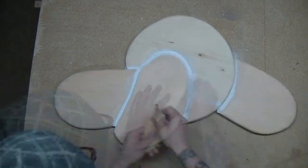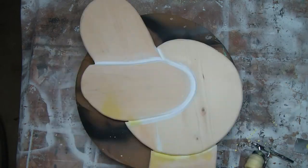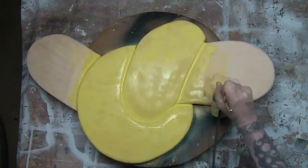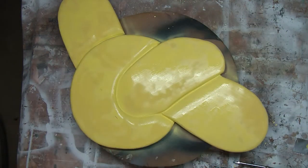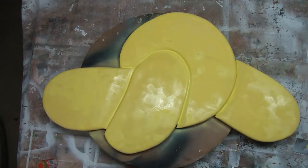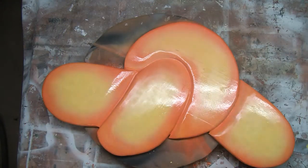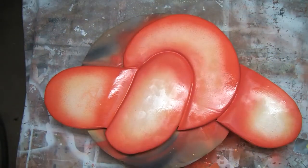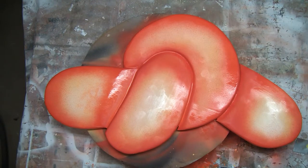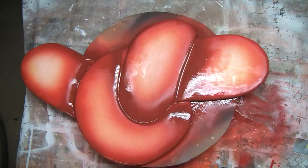Then what I'm doing here is I have some wood filler, and I'm filling in the gaps that I couldn't get perfect, in hopes that it smooths out. I leave this overnight. Back and sanded up where I'd put my wood filler. Now I'm relatively new to the world of airbrushing, but every time I do it I learn a little bit more — how to mix the paints, the correct pressure settings — and it is a real cool option for a neat look. I'm enjoying airbrushing very much. So I started out with yellow and was going to make it yellow, but then it somehow kept going darker and darker, and the thing ended up looking like a giant hot dog. So I did the next logical thing and began painting it with mustard.